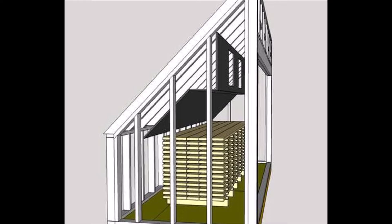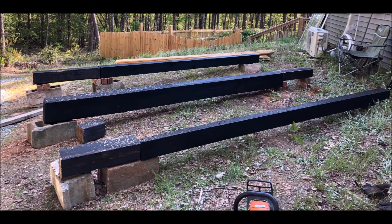Because my kiln sits behind my garage facing due south, I couldn't easily put doors on the back, so I chose to put my door on the side. Most solar kilns have you load the wood with a gap in the front to allow for airflow. Some sort of baffle is then used along with fans across the top. The baffle is usually dark in color to absorb as much solar radiation as possible. The fans then drive the air downward through the gap in front and then through the wood stack. This warm air is naturally lower in relative humidity and pulls moisture from the wood. The moisture-laden air then rises up to the fans to make another loop. Outside vents are to vent out excess moisture during certain times of the drying process.